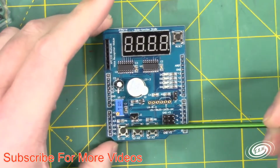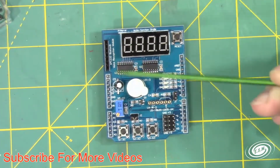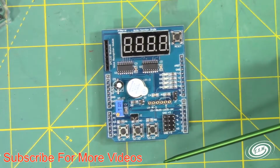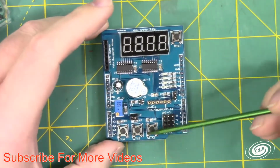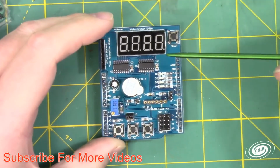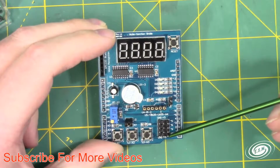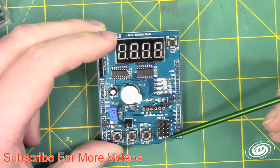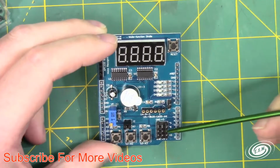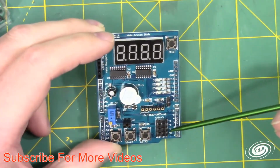It has three buttons, and like I said, there's no instructions for this, so you've got to kind of figure this out. It does list some of them, like button one is on A1, A2, and A3 for these buttons, which, you know, a button on an analog pin is a little weird. Normally I put my button on my digital pins, like my interrupts and things like that, but that's okay. And then we have A5 here on this first set of pins, I guess for a potentiometer, because you have ground and 5 volts. And then you have your 3 PWMs, so you could technically plug a servo in there if the pins line up correctly. I have to check that.